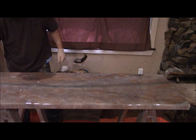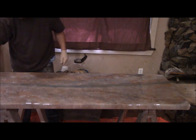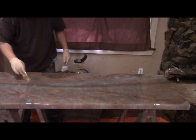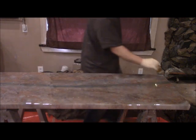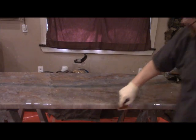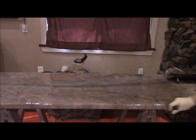You can see all the little bubbles in the surface — that's normal at this point. We're going to torch those out. You don't need to torch them right away. Now because I chopped all the way to the edges, I've created more drips, so go back and hit those edges again. This time it's much easier — there's not a bunch of drip marks and they're all coated, so the brush just really slides easy on those edges.